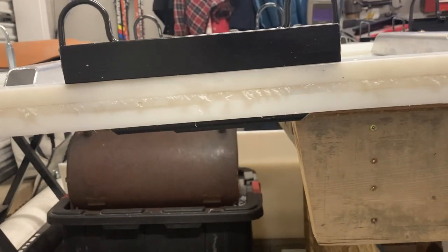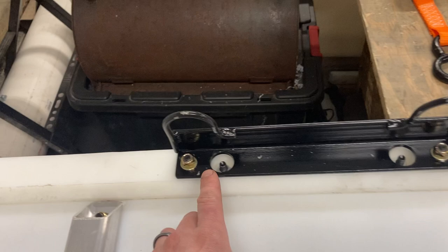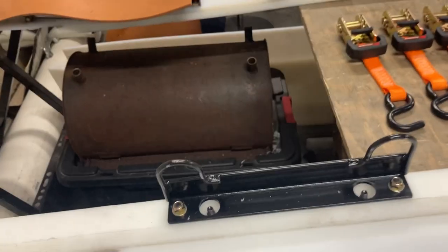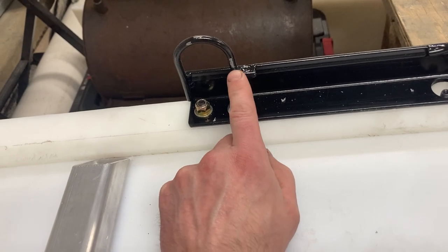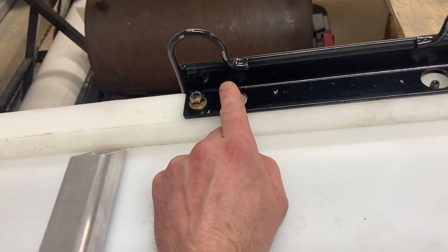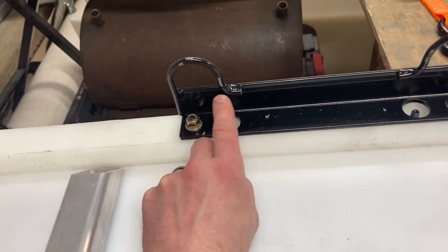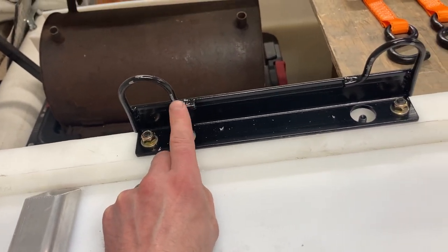The bars here are because there are carbides there, and if you don't put bars there the carbides don't bite - still a little bit of welding but nothing serious. You can see these are all drilled out so you can get your socket down to the carbide and change it out. There's also no welding up and down on the bar, which would create a weak point where it's going to want to break - welding here and here, but none up and down.